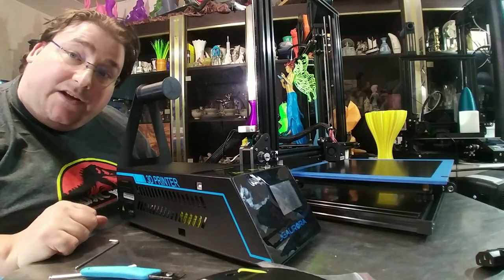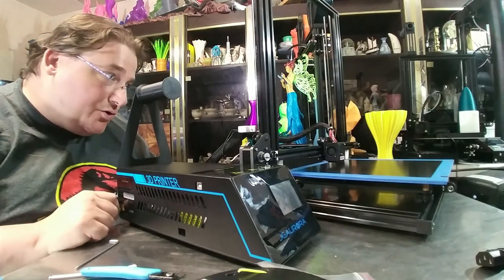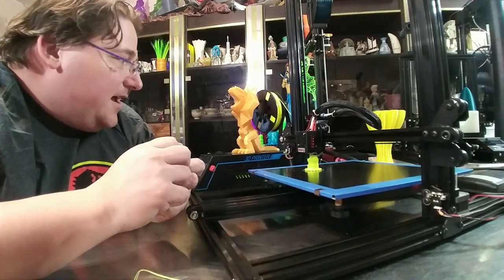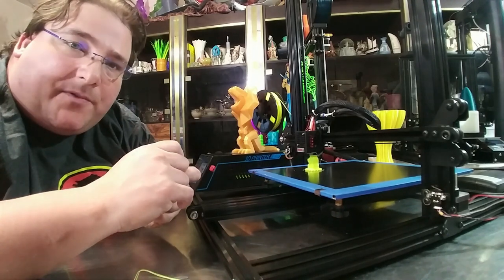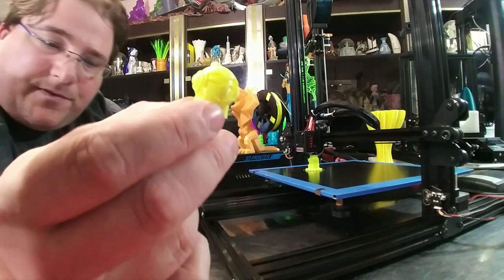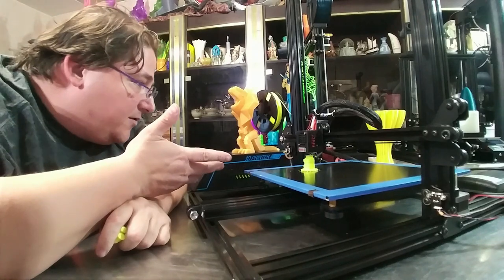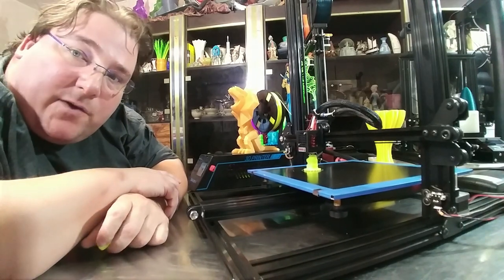All the wires are plugged in. I do find it interesting to note this has dual Z lead screws and dual Z end stops, so you should never have to balance your X-axis — it will rebalance every single time you level the printer by leveling both of them. That's pretty cool. The JG Aurora A5X is working well. I was able to level the bed in one shot by eyeballing it — I did not have to tweak or adjust the knobs — and it's working fabulously. Here is my first print, my bed leveling Marvin, with its long skirt going around the entire bed. Now I am printing a Haribo Gnome — the little Protonome gummy bear version — and it's printing great. I do see a little bit of salmon skin, so I may be adding TL smoothers to this.